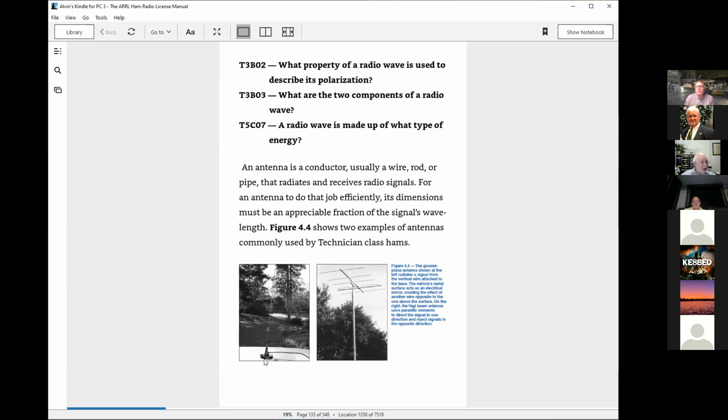All right, people are always asking about this. These are vertical antennas, mag mounts. A vertical antenna is actually half of a dipole. You saw that the dipole had a positive and a negative end. Well, where is the other end of this vertical antenna? It's only a quarter wave high. Any guesses? No questions? No answers? The cord? Nope. The actual surface of the car roof. That's right, the vehicle itself. It's acting as a counterpoise.